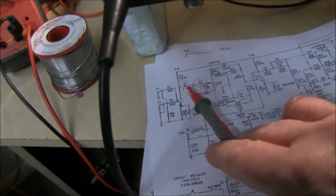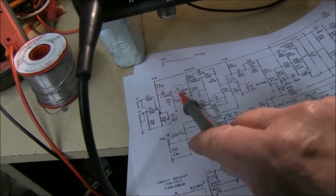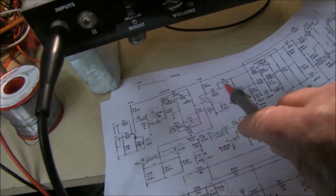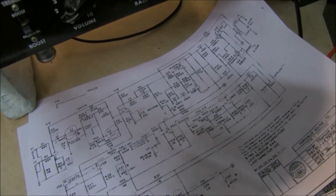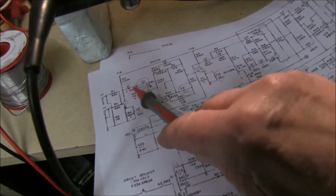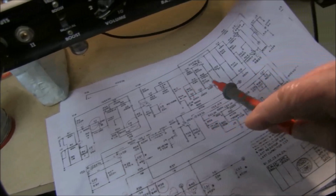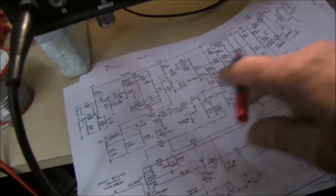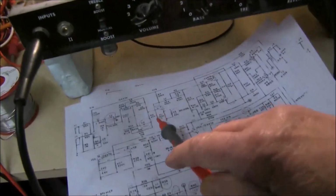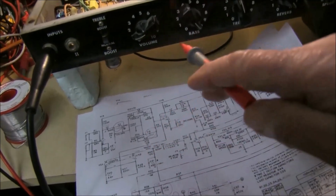But you have to be careful, because looking at the circuit diagram, when you switch this in, the switch here, it passes all the high frequencies straight from the input past the volume control, and then if you've got the treble on high, past the treble all the way through, and in fact makes the amp, the treble, be running flat out, maximum volume. Normally you'd have another padding resistor in here to prevent that a bit, so the volume control could still limit the treble as well, but that is why most people find it too bright, because if you have the treble up as well, it's just like running the thing flat out with all treble. Can be a bit piercing. So if you switch this boost on, it's best to have the treble at least turned down a bit to prevent all the treble going through. And I'll show you again, the bass has got a massive wide range.